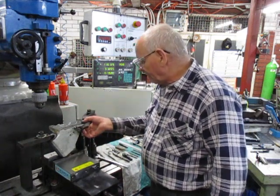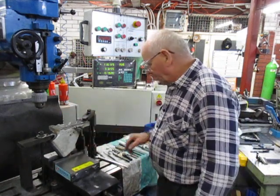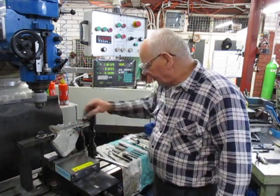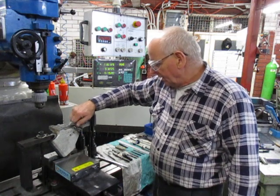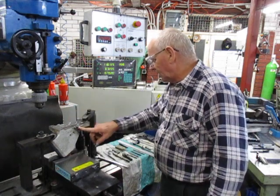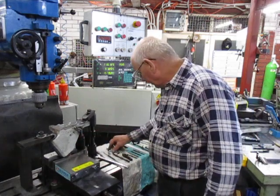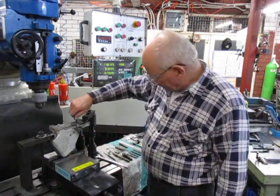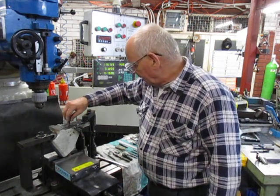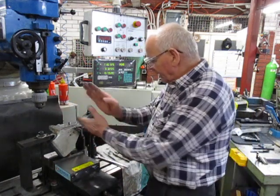Some of these holes went all the way through, and some of them there's other castings and webs in there. I also decided to come through here and capture a bit in there. So I've drilled down and I've tapped, and I'm going to capture this section here as well through screwing that. And in two places here I've connected to a web underneath. This screw there goes all the way down and captures that crack through the web.